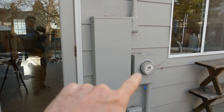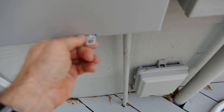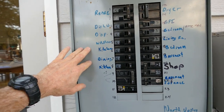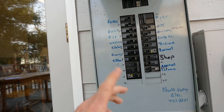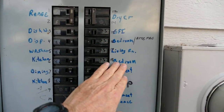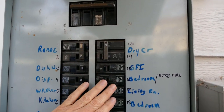So that's how I first make sure it's safe to open the panel. This is the panel box, and this is the panel cover. Under the cover there's usually a tab to lock it shut so the wind won't blow it open. When you open it up, there's another cover — this is called the dead front cover. It's called dead front because it's not live, not hot, not energized. Back in the day they used to have energized covers, so they called this a dead front cover. Here you can see labels, and here you have the main breaker in this panel.